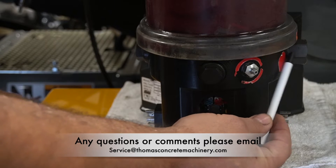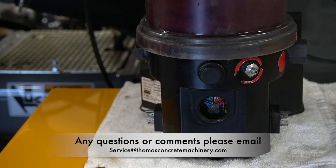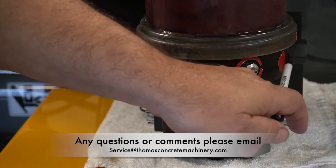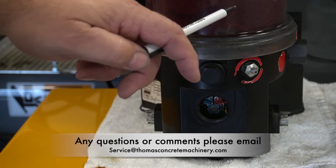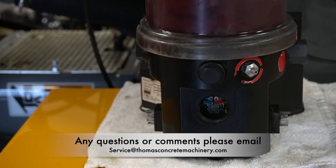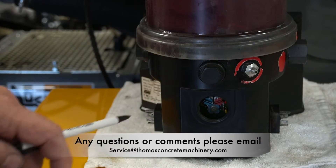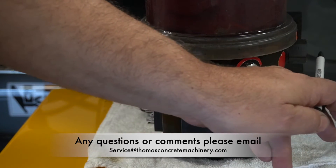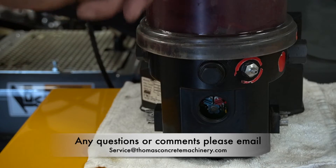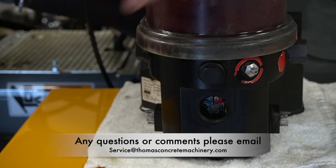This unit here is the actual pumping unit. The pot runs around and pushes the grease down into this cartridge. This is called the pump element and it pumps out the grease. If the pot goes empty, you need to remove the check valve right here and turn it on to bleed the air out, because you can have a full pot but still have an air pocket. So try not to let this run empty. If it does and it doesn't grease, you need to pull this off and then churn it.